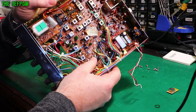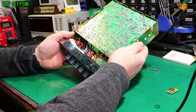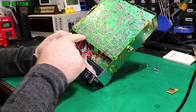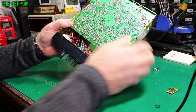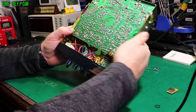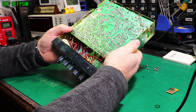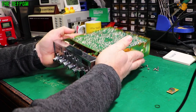I don't like this transistor sitting like this — that doesn't look good. That looks factory though; can't see any signs of anything. Maybe a bit around here — that looks interesting. Yeah, I think that's been resoldered. I think it's actually had the backlight bulb replaced at one point, because the connections come through here and those have been resoldered. So that's not too surprising — it happens a lot. Otherwise it looks fine so we'll get on with it.